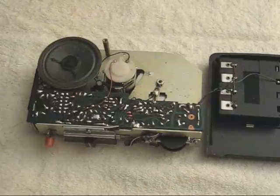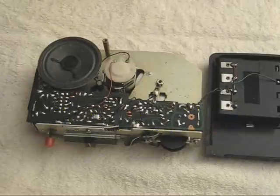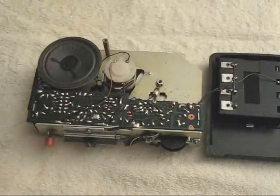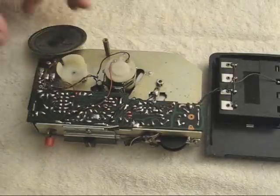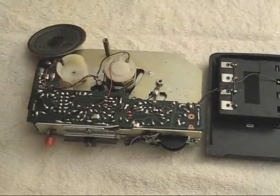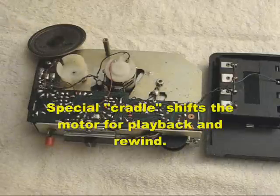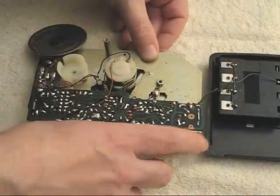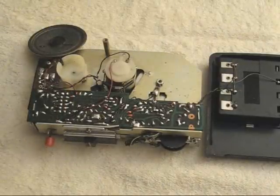This is the entire circuit board for the machine. It controls the motion of the motor and also the amplification and record playback function. There is a very tiny speaker located here which sends sound out through the bottom of the machine. The speaker is not held in permanently — it has a small cup that holds it in place. With the speaker removed, we can see the little motor that drives the tape take-up and rewind reels. The motor has some springs located in a cradle, and as the machine switch is moved, the motor moves — which you can't really see because the motion is so tiny.